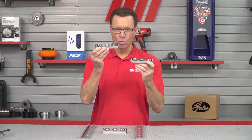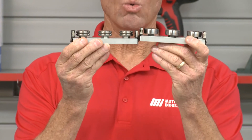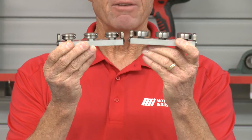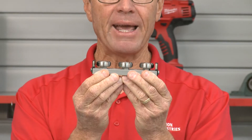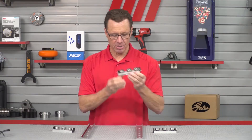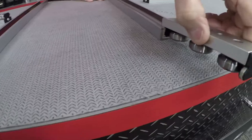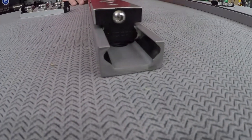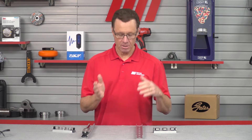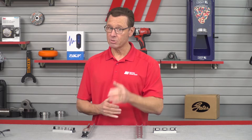This is a hybrid design of the dual V-wheel and crown roller wheel Utilitrack series. The VC V-Crown series incorporates a versatile wheel design which can run on both the open and the C channels. Here we've got the open channel — no problem right there. Then we've got the C channel right here. The VC series simplifies your design and bill of materials since it pairs with both the open and C channel profiles, ultimately requiring fewer parts.